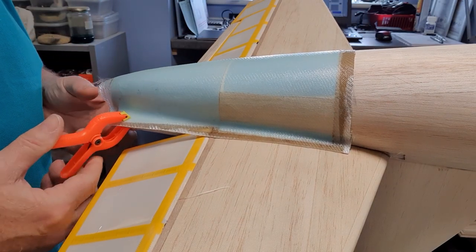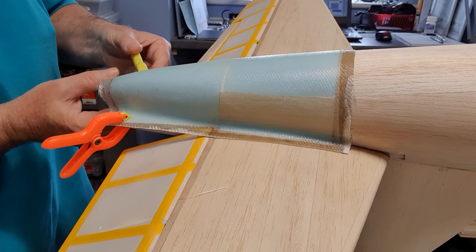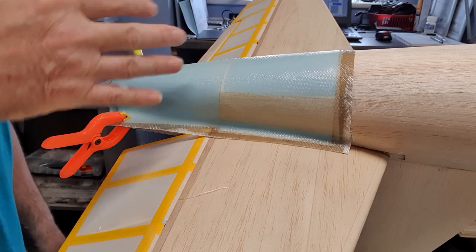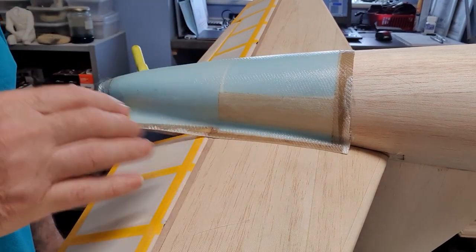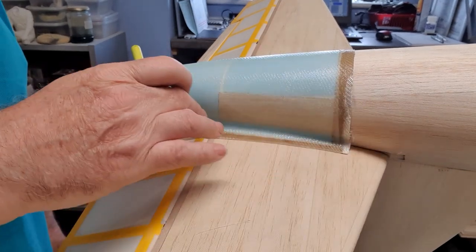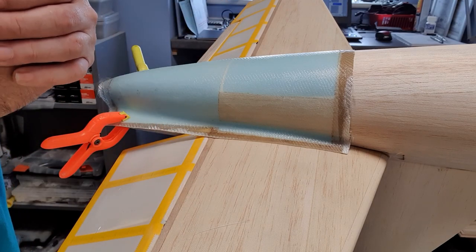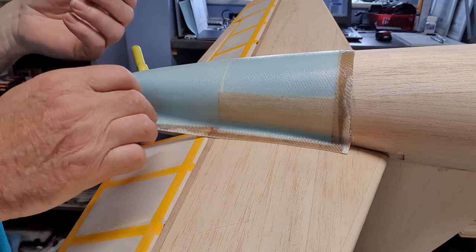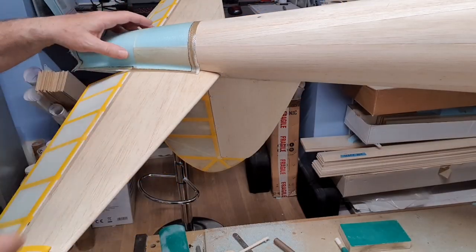So I'm just going to clamp these two little sections here that seem to want to lift a little bit. I'll just clamp them down while it hardens off, and I'll take another look at it tomorrow. And it should be nice and fresh and dry, and really, really hard then, really firm. And then I can trim the shape that I actually want, flip it over, put some PVA release agent and some various stuff inside to allow the glass to pop out, and we'll cast a panel.